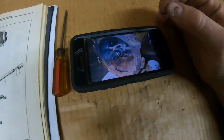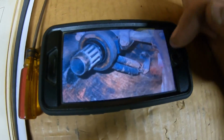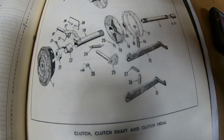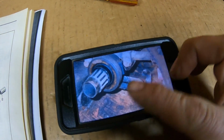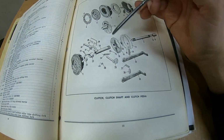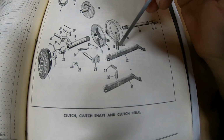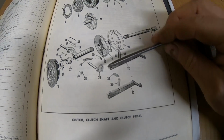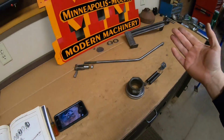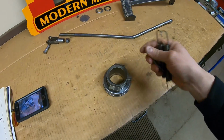But when we took X231 apart, we found 2 springs pulling on that release bearing. And another difference was the clip was pointed down originally. I think I'm going to position it like the parts manual diagram shows, with it facing up instead, because that's going to give me a more direct rearward pull on that release bearing. So the reason why I think the production only had one spring on that bearing and not two is because they have number 34. That's a second spring that is hooked to the clutch pedal and also pulling the clutch pedal up. So those two springs work in tandem with one another. The prototype does not have a spring on the pedal, so I believe that's why we've got a double setup on the release bearing, and that's the way I'm going to keep it.